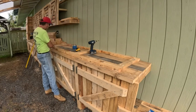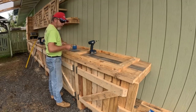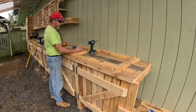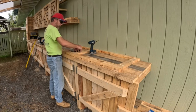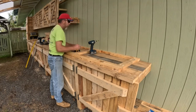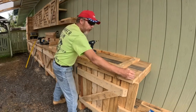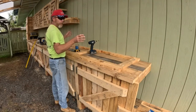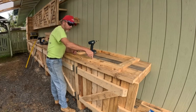We've already done the end piece and I've showed you how those go on, so now we're going to do the cross pieces. I've taken a measurement and marked the center of our first pallet wood runner — that's where our center support is going to go. We're going to install our screws into the pilot holes and the pocket holes that have already been drilled, secure those together, and that's going to be one frame. Then we're going to do another frame — one frame here and one on the outside — then attach those with some cross pieces and to the deck. This is all pretty rustic simple build with the minimum amount of tools to make a functioning workstation.